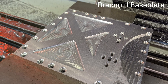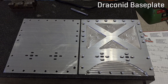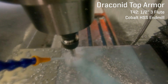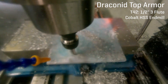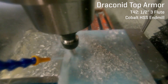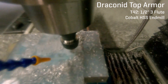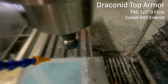Here you can see my finished base plate part, with its horrible blemish from where the collet nut rubbed against it when the drill crashed, but otherwise perfectly usable. Now you can see me making a much simpler part of almost the same general form, which is the top armor for the robot. This is also pretty heavily pocketed, but I left a diagonal strip to reinforce everything in the middle. The diagonal portion is only pocketed down about a sixteenth of an inch, and most of the material is still being removed to about an eighth of an inch. Again, I'm using the half-inch tool to hog out as much material as fast as possible, then coming in with the 6mm tool to clean up everything.